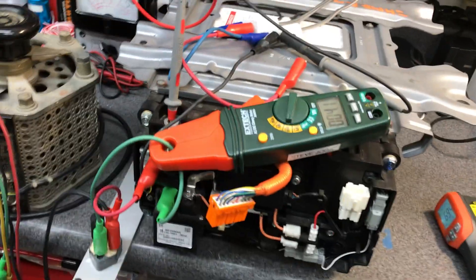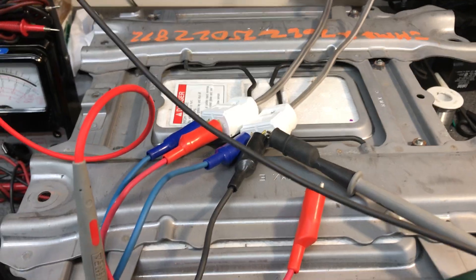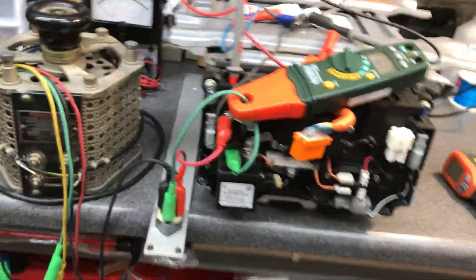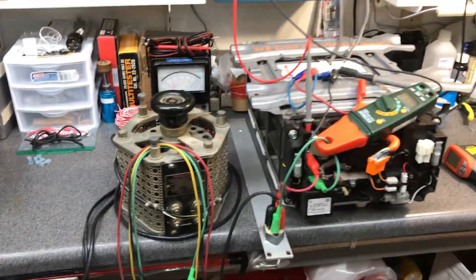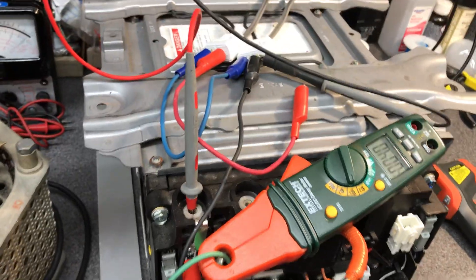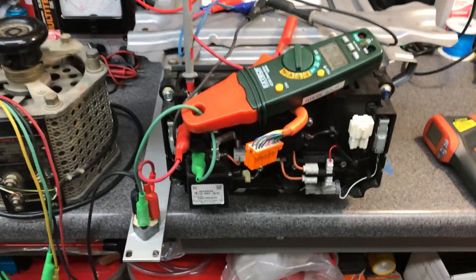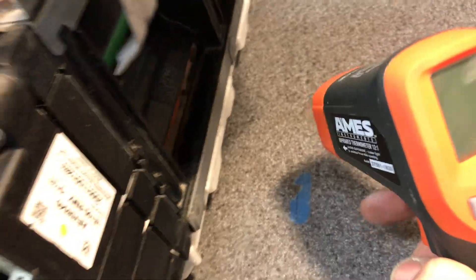We're going to have to cycle it. It's already down to 4 amps — nickel metal hydride. I'll cycle it a couple times and let this charge. I have no real easy way of detecting end of charge, because end of charge on NiCads or metal hydride have that little dip in the charge curve. So I'm either going to have to go by temperature — I could probably catch the side of the cells here with the infrared. Maybe that's the way to do it, though it's pretty crude.